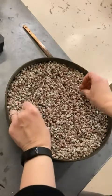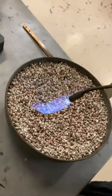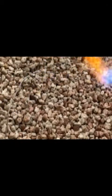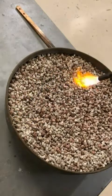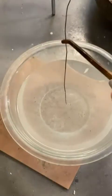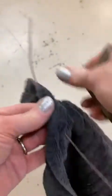Next, we anneal it. Lay it all along the inside of an annealing pan. Apply the flame, and when you see the spotlight, go four more times, then turn it off. Grab the wire in the middle, sweep it through the water, and dry it off with a towel.